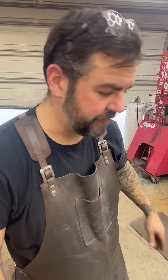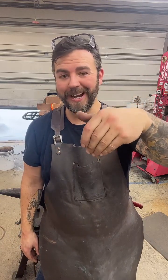Okay. Do you heat treat an axe different than a knife? Yes and no. So I'm not going to fully submerge the axe head right off the bat in the quench. Now I want the hammer side to be pretty hard, but what I'm going to do is go in about that far on the blade, wiggle it around a little bit, make sure the bubbles come off, then I'm going to go all the way in, and so the edge, the blade side is going to be the hardest, but the rest of it's going to be pretty hard too, and then I'm going to temper it back, probably pretty significantly, probably come down to the low 50s as far as Rockwell.